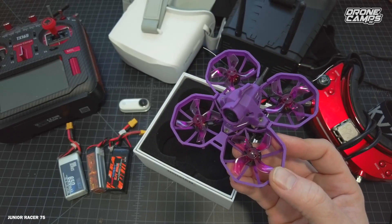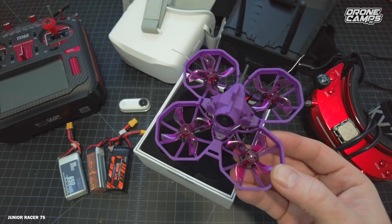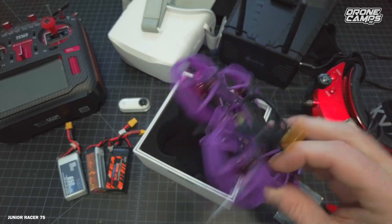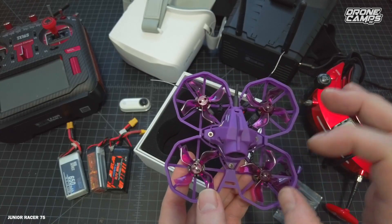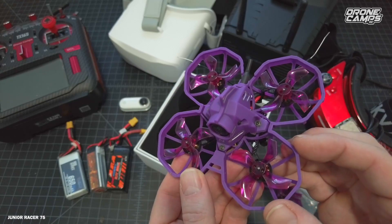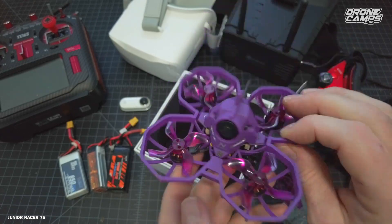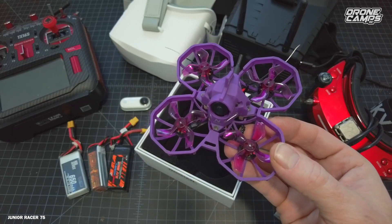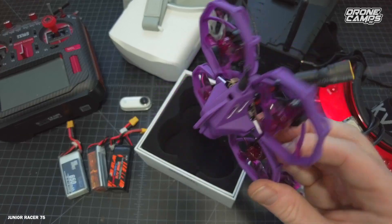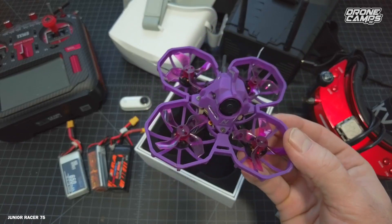This is a little indoor or outdoor multi-GP-style micro brushless racer. It is not a freestyle quad by any means. It does have some tumble — we call it washout in the FPV hobby — where the flight controller has basically a hiccup because of too much outside external opposing forces, whether wind or a flip. Normally it will come back to correct itself in stabilized mode. Betaflight is open source and is on here; you have a USB Android-style connector on the bottom to connect to Betaflight.